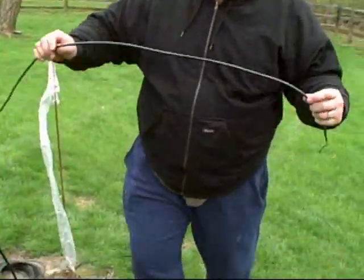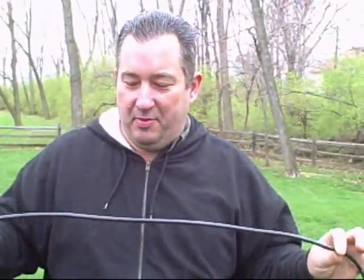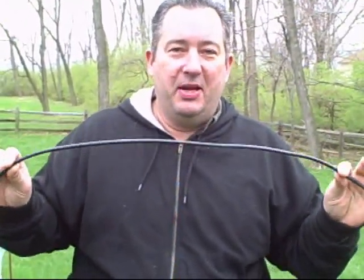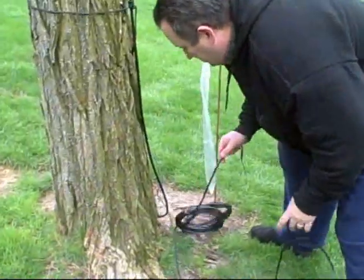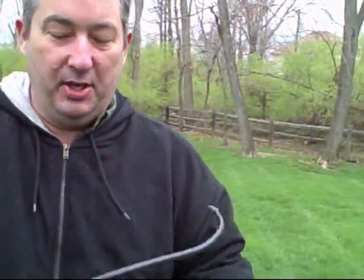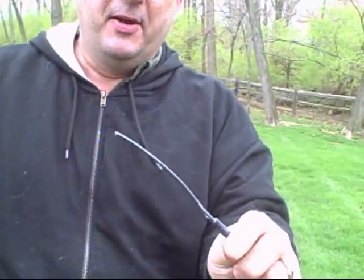The ground radials are special radials that we make at Radio Waves. They're thick. Most people have the mindset of using a simple thin wire, which in many cases is fine. But believe it or not, a thicker ground wire does make a difference when it comes to noise level. Each one of these wires are bundled separately and sealed so that when they're buried, no water will permeate inside the cable itself. You can see it's all sealed, and then we have a little ground pigtail on the end. The idea is that we want this to last for many, many years.